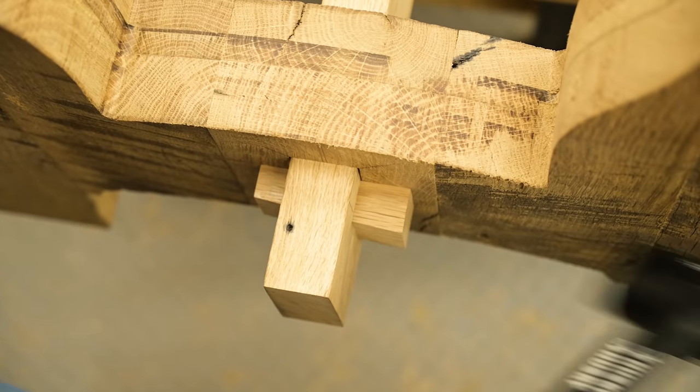It's all glued up. Again, we're trying to keep a lot of this patina. I think I've said that like 10 times. So we're going to sand this down. But before we do that, the client wanted some colored epoxy spots, and we have a few natural places that lean towards that, but not enough to really set this piece off. So where some of these knot holes are, I'm going to try to trace them best I can and route them out, since they might end up popping out eventually anyways, to give us a few more places to put some epoxy.